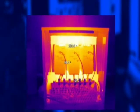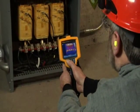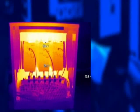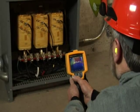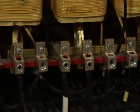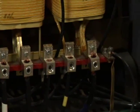Compare the temperatures of similar components, such as terminations and coils, to one another. A higher temperature on one phase may indicate unbalance. A higher temperature on the neutral termination may indicate the presence of harmonics. If the temperatures throughout the transformer are substantially higher than expected and the unit isn't in direct sun, then you've got a problem with overloading and cooling. Another thing to look for in a thermal scan is loose connections — long-term vibration can loosen connections, causing both overheating and sometimes excessive buzzing.